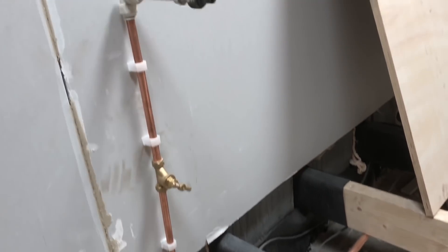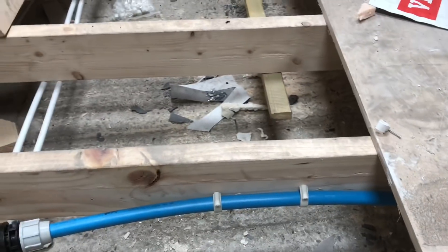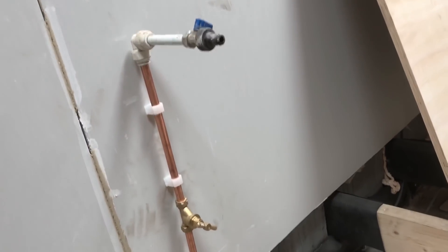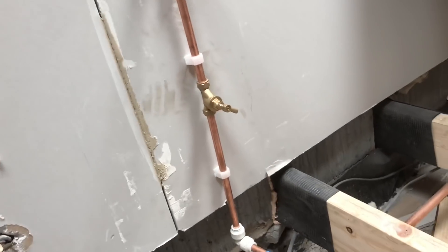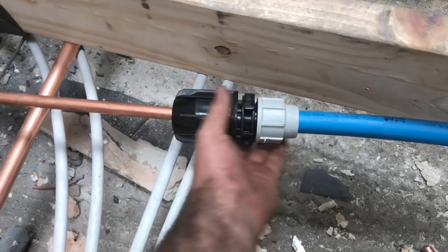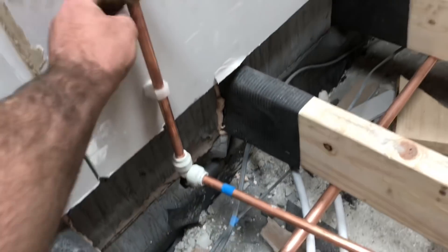This goes into copper now. This is all first fix, so this actually won't be staying like this. First of all, this pipe needs insulating and needs securing properly to the joists, then securing and insulating underneath the house. This is temporary so that we can just get some water on for the lads so they can continue with the dry lining and plastering. Obviously there'll be a drain-off valve and a check valve for the stopcock as well. The process I want to go through now is just the test — all of this is now an active live line with water in it.